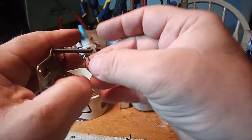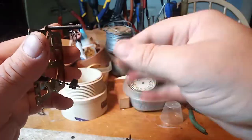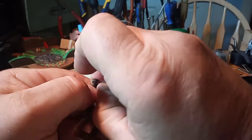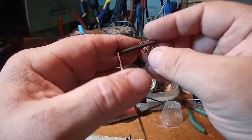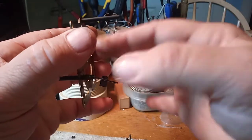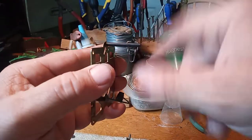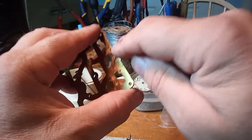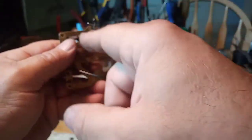The last thing to discuss is this piece of wire right here. If it's squished in, it doesn't allow the pendulum leader wire to swing back and forth easily, so you need to spread this apart — something like that. If it's spread too far apart it goes up into the bends. This is called your post — this post unscrews, and I would not recommend unscrewing it, because the more you unscrew and screw it back on, eventually the threads will wear out. When it's overtightened it's no longer going to be parallel with the ground.